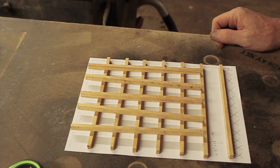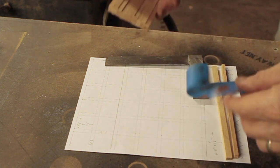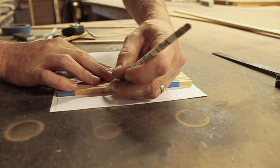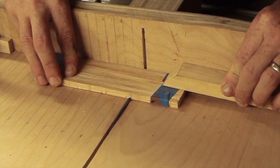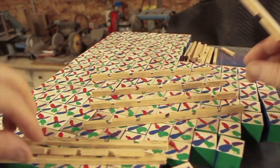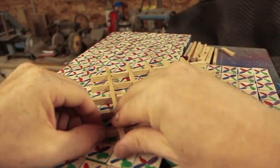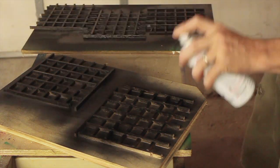The negative spaces need to be big enough to hold your cube — just take into account the thickness of the pieces in between. There's a little tray at the bottom about the same width as the cubes for holding the dice. I found if I taped all these sticks together I could cut them like one piece of wood. I used the layout grid to figure out where the notches would be and notched them on the table saw. The cubes are one inch but the holes are one and an eighth inch so they fit in loosely, because if they're too tight it's too hard to play and get them out.